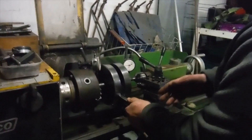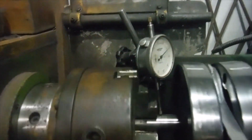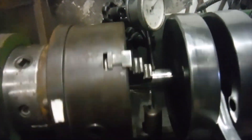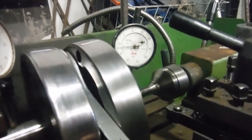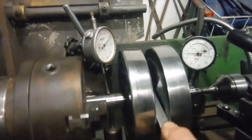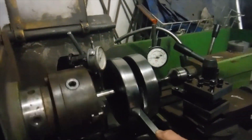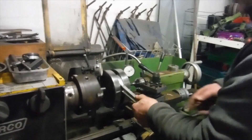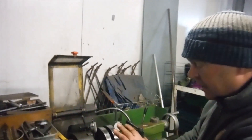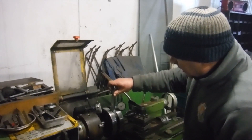Using the center on the tailstock, I've got readings where we can see about a thousandth of an inch on that clock on the drive side main shaft where it would run in the main bearings, and over here on the timing side we've also got a thousandth of an inch. If we look closely, as one needle rises the other one falls, so you've actually got a total runout of two thousandths of an inch overall — which is more than acceptable. It's very good; you could even get away with three or even four at a push, so two thousandths is great.